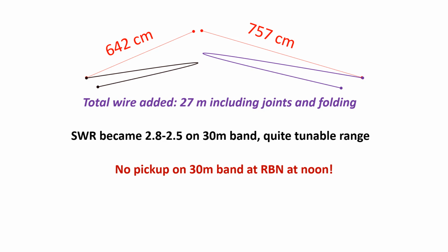Now I may be having slightly more than the required amount of wire for 80 meter. As linear loaded dipole with 3 layers is likely to have 1/3 of the impedance of a regular dipole, I made the sides asymmetric to increase the feed point impedance as I do not have a matching transformer.